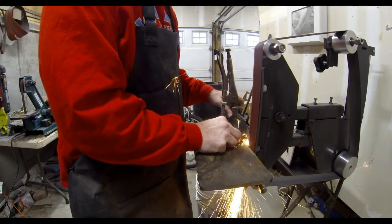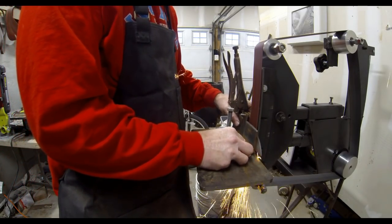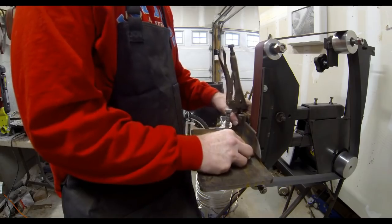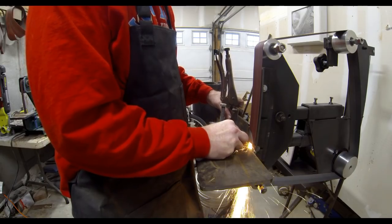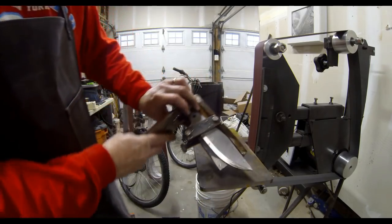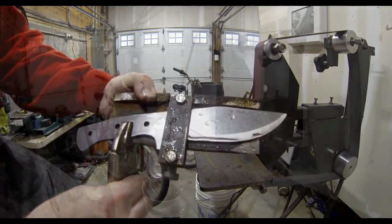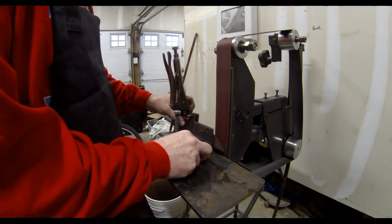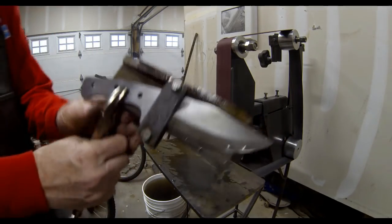1095 is a really nice steel to work with — it doesn't take all that long to grind down these bevels. For this particular project, because I was going to glass bead the finish, I wanted to leave the bevel kind of rough. I would normally grind the bevel with 60 grit paper and then finish it off with 400, but for this particular one I just left it at 80. I figured after it was glass beaded, I wanted to be able to see some of those horizontal belt sanding lines on the bevel itself — just a different type of finish.